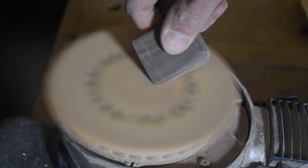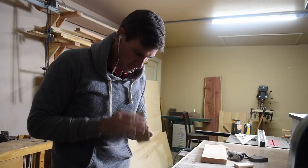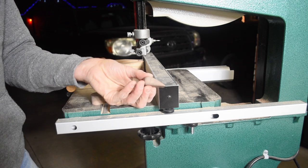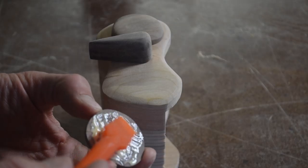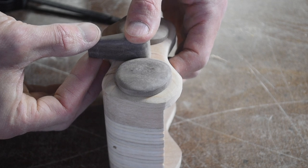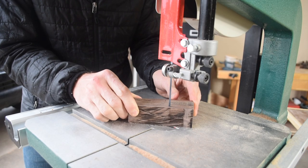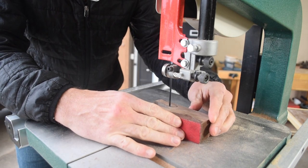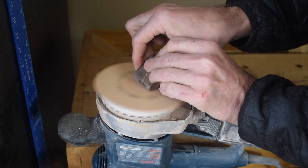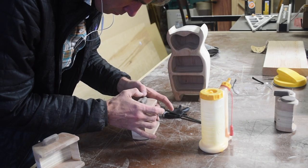And like I said earlier, this project requires lots and lots of sanding. Once that was done, I glued the eyes and the beak onto the top drawer — the beak was allowed to overhang, which essentially becomes the drawer pull. The next day I made the drawer pulls for the bottom drawers the same way as the eyes: cut a cylinder on the bandsaw, shaped it on the orbital sander, rounded over both sides, then cut it in half and glued the two drawer pulls onto the drawers.